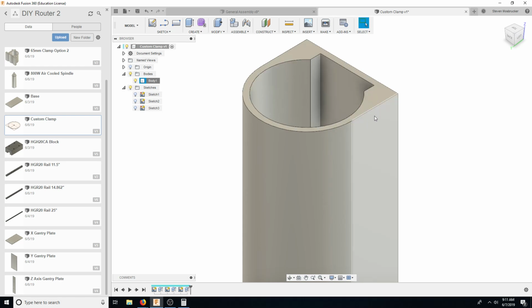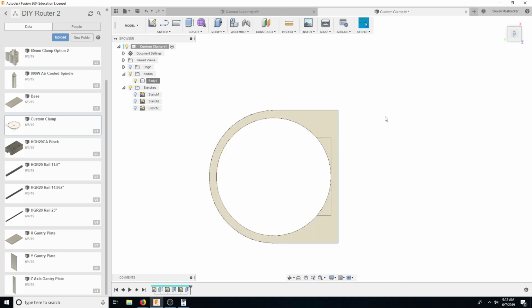But if we have a clamp here, we're going to hit the edge. Pretty much no matter where we put it, we're going to hit. We're going to lose area no matter where we put it. So if we put it here, here, here, the only thing is set screw. And we can't make this flexible because it has to maintain the holes. So maybe a set screw from the back and make this really, really tight tolerance, but this is pretty tall.